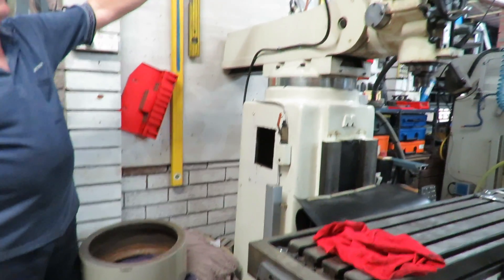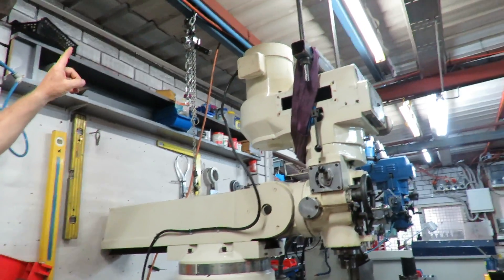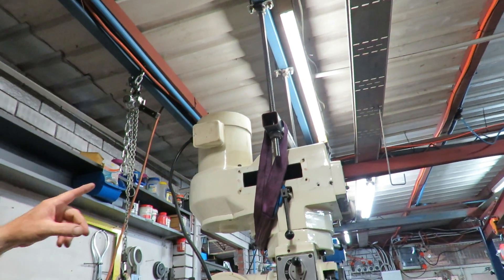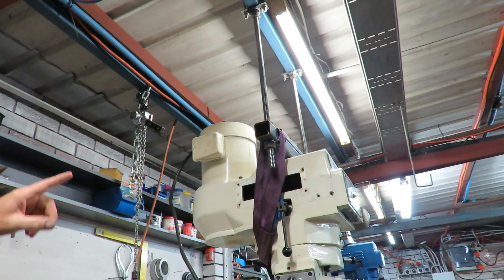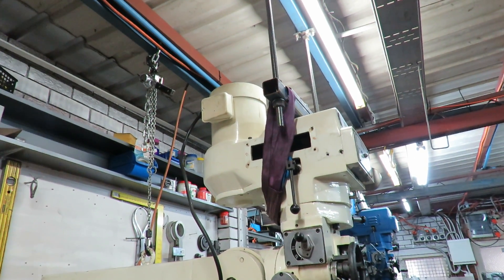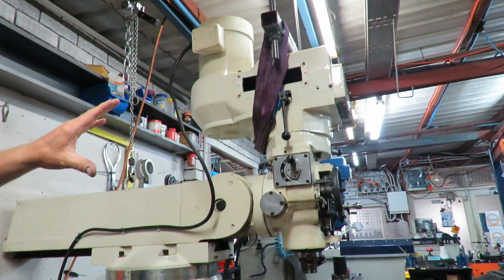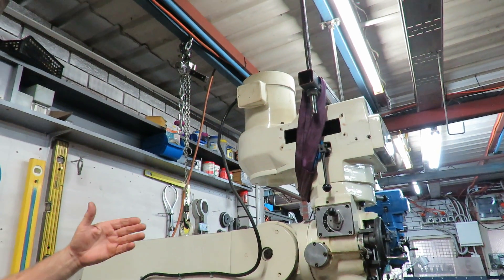In order to lift it, if you come around here with the camera — what I've done is I've put two beams up across the ceiling above the two trusses, and I've made a double dropper down from there, with a beam across and a bolt through the pull thread, and put a piece of threaded rod in there. That's what I'm using to lift and to stabilise the head.